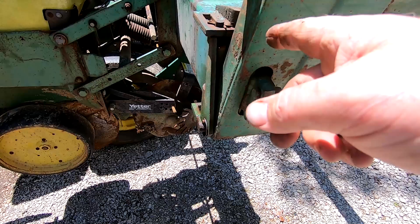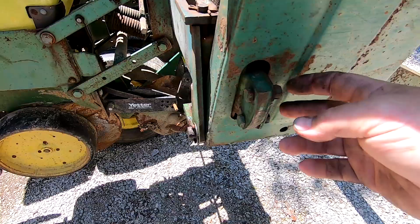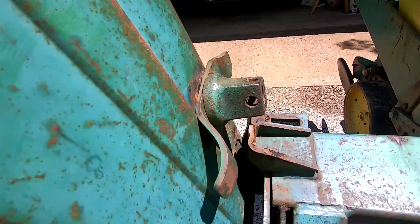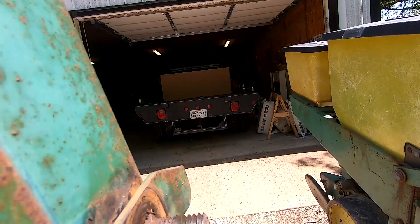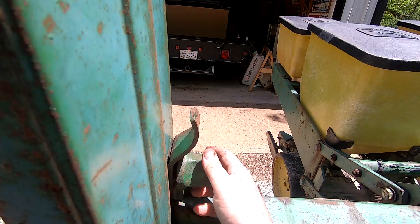What we're going to do is take these bolts out right here, which hold the cable, and where the cable attaches — that'll allow this marker to come down and give us access inside. I'm also going to have to take this pin right here out, and this will rotate out of the way and give us a clear shot at what's inside. I'm going to put the lock back in place while I take this cable loose, because I really don't want this thing falling on my head. That's how you put that on — it'll hold that marker up mechanically, taking all the pressure off the cable.